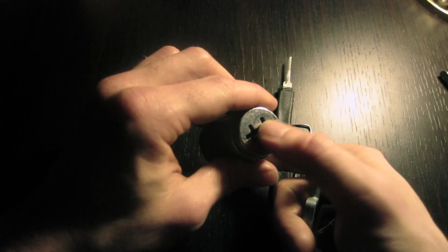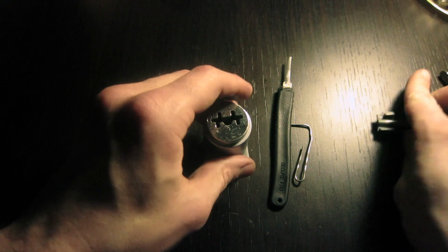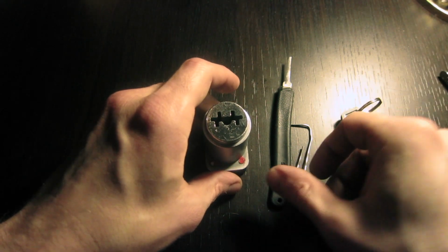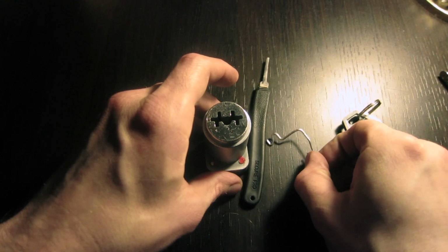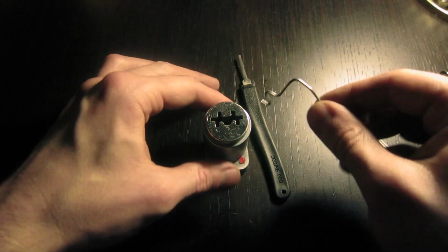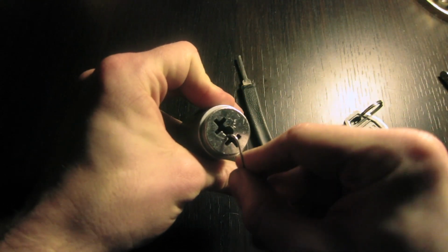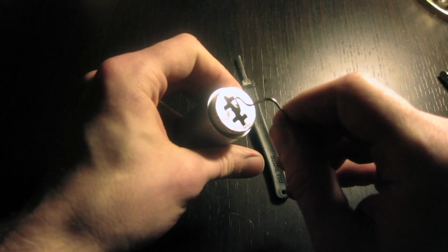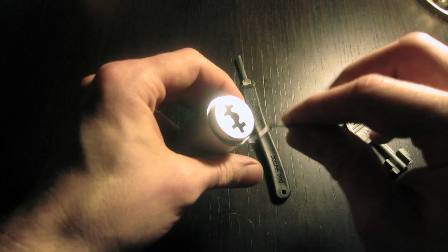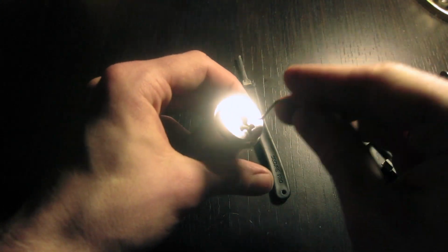The main problem that I had while picking this lock was tensioning it. To simplify this, I came up with a tool like that one. It fits into this keyway and allows the core to be properly tensioned. We cannot tension this lock from the outside, because this outer plate doesn't rotate, and the part that actually rotates sits inside the lock at a depth of about 1 cm.